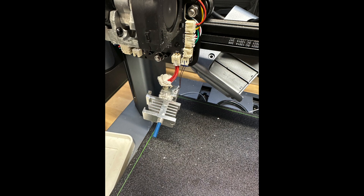So how do you resolve this? In the forum on Discord, it was recommended that you preheat the nozzle back up to 260 degrees Celsius and use a tool such as a pick to remove the filament from around the nozzle. And that worked for many people. But in my case, the thermistor connector had become separated, and each time I attempted to preheat, I got a failure to heat error on my printer. I wound up having to use a Dremel in order to get access to the screws that held in the heat sink and the nozzle. And I was able to get the assembly out and then repair that connector, put it back in the printer, and preheat it to melt the filament so I could remove it.